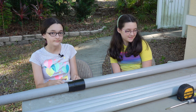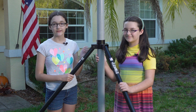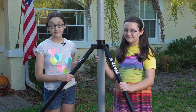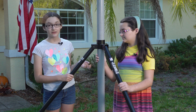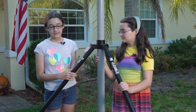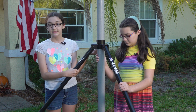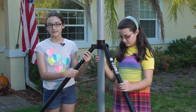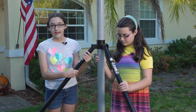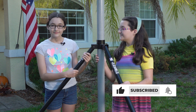We're going to mark the rest of these poles off camera and then show you what it looks like set up with our TN07 Engineering tripod. We have the TN07 Engineering Heavy Duty Mast set up with the TN07 Engineering tripod. This works really great with their mast because when you're trying to put up the mast it's really easy to keep it vertical. In higher winds it's hard for someone to stand here while others put out the guy wires, so this is a huge help. Also if you only have it at 15 feet you don't even need guy wires most of the time. Thanks for watching!